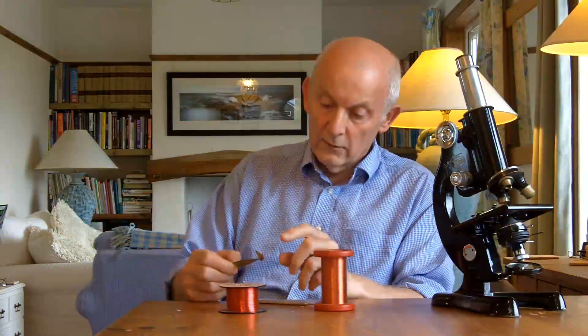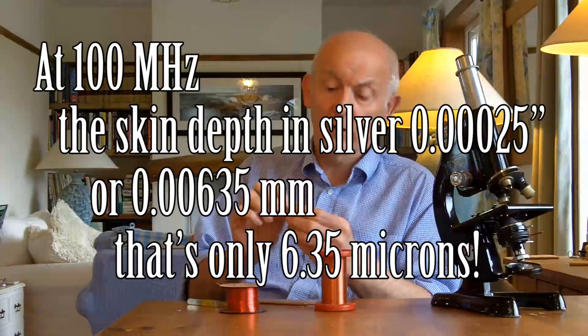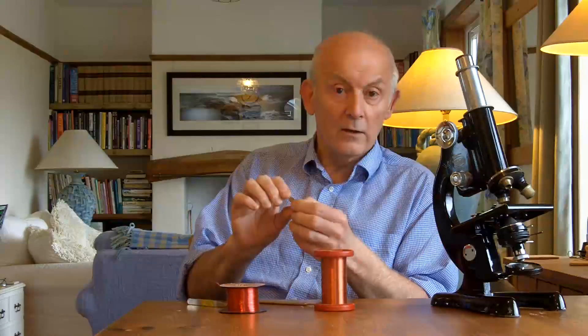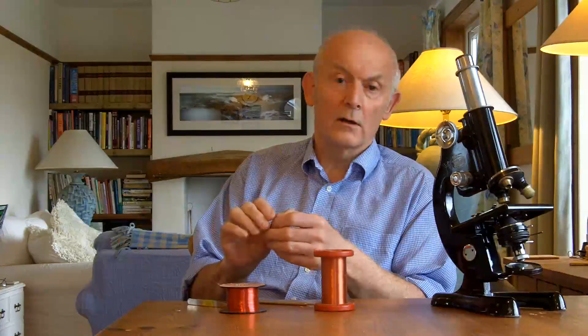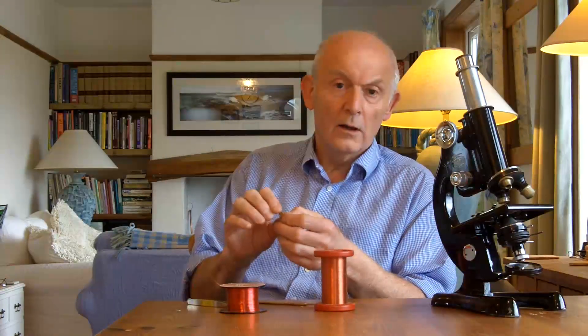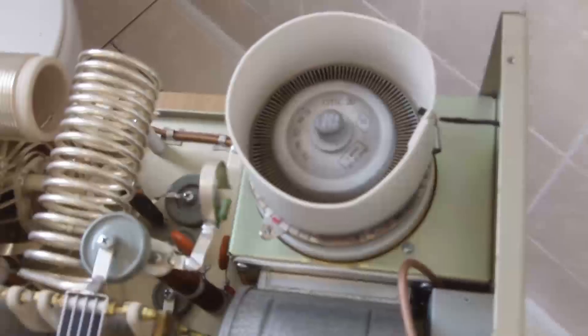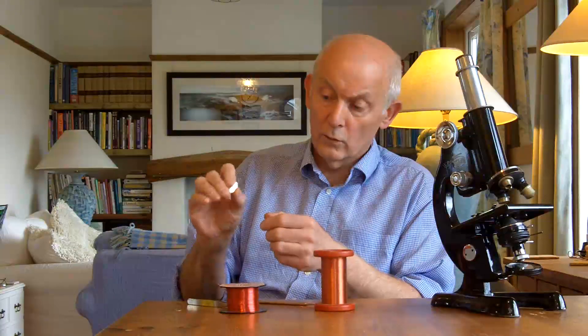So what's that got to do with this silver-plated capacitor? Well, when you get into the megahertz range, the skin depth is so shallow that the current will actually flow within the depth of the silver plating. The silver is chosen because it's a good conductor and will carry those high megahertz frequencies. So in an HF set you'll see the coils and larger chokes will be silver plated. If you've got a linear amplifier, there's every chance the chokes in there are going to be silver plated, if it's a good one.